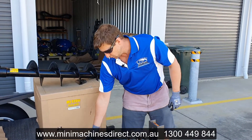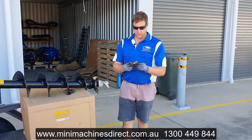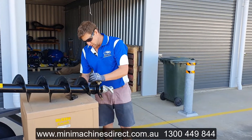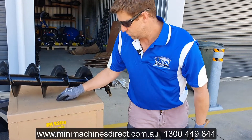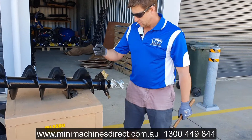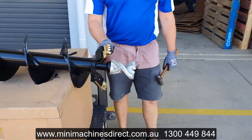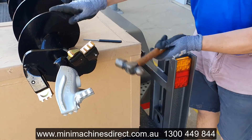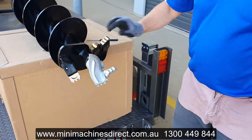To put the tooth back in, simply ensure it's got the rubber grommet in there, slot it over the tooth pocket, and take your new pin. I like to put it at the bottom — it's just easy to access. Tap it most of the way and then tap it home. And this is all secured.